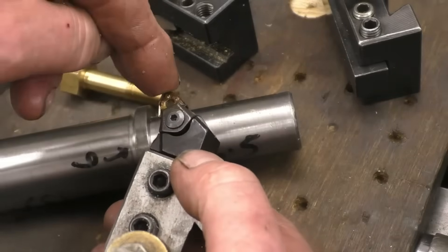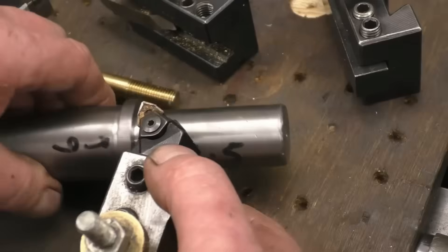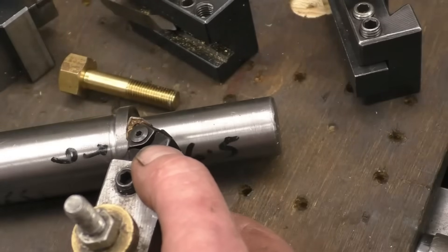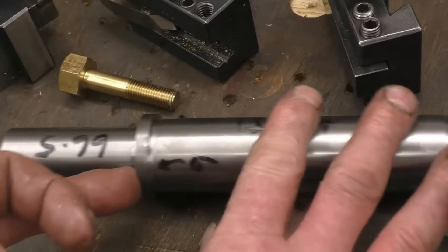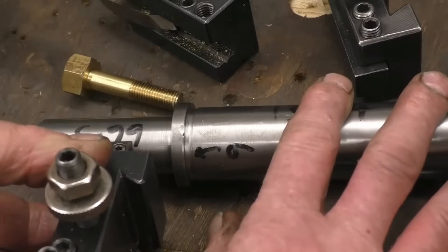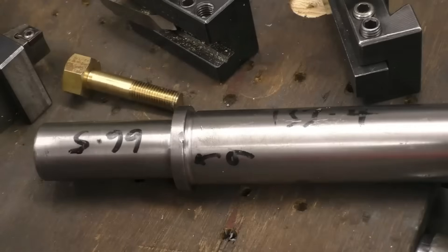That's another right hand knife tool. As you can see, that's also less than 90 degrees, and it's got a more pronounced round tip — that gives a better surface finish but it will leave a bigger radius in there. There is a way of getting around that which we'll cover as we carry on. If you wanted to put an edge like machining to a face, you would use a left hand knife tool, which will machine in there and then come out. So there are the tools I'm going to be using; I'll find a piece of suitable bar and we'll have a little experiment.